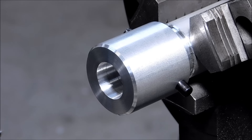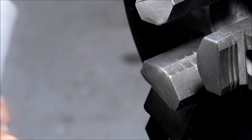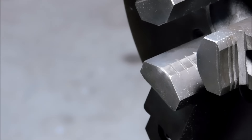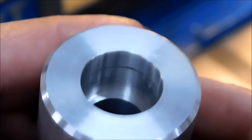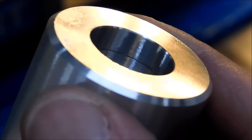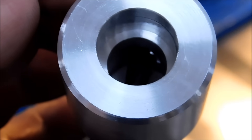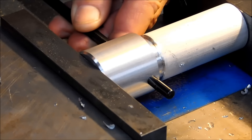That is all she wrote, and judging by what I see down inside the bore, I think we got lucky. It looks pretty good down in there. In order to remove the pin, you're going to have to take it back over to the mill, apply end pressure - it'll help alleviate some of the pressure on the pin - and you can drive it out there. I would have to say I'm fairly happy with what I'm seeing.